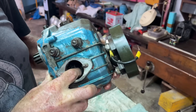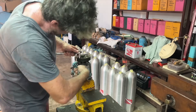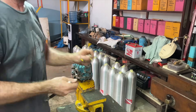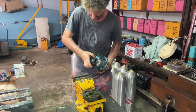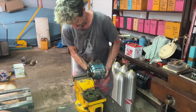Now you can see into the clutch assembly - this is basically forwards and reverse throwing the clutch forwards and backwards into the gears. Next up, take the adapter plate off. This is the sort of anti-vibration plate that attaches to the prop shaft and takes out any vibration or misalignment you might have. Once the adapter plate's off, you get out your big boy socket - I think it's a 30mm or 28mm - and wrench that big bolt on the end of the main shaft.